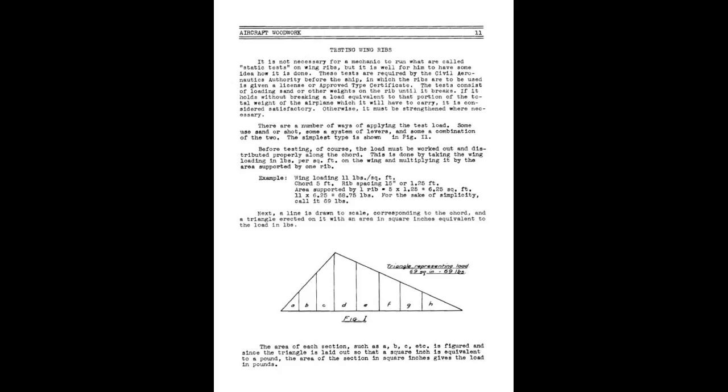This may change if we get more information. So this is research on the go, so to speak. A loading factor of 7 times 27 pounds gives us a test weight of 189 pounds or 86 kgs, which is basically the weight of a person standing on top of one of these ribs, which seems like a heck of a lot, but I'm not going to know until I actually do the test on it.